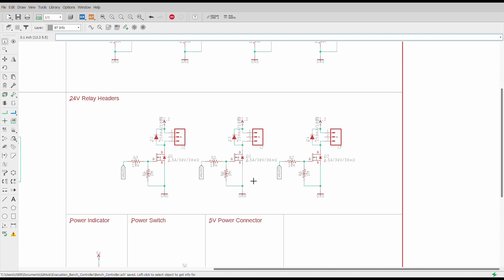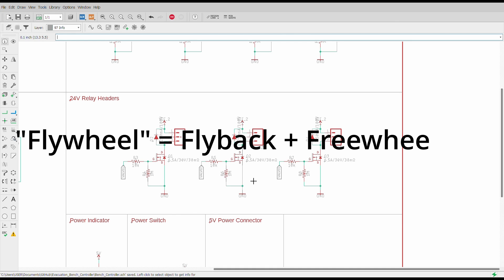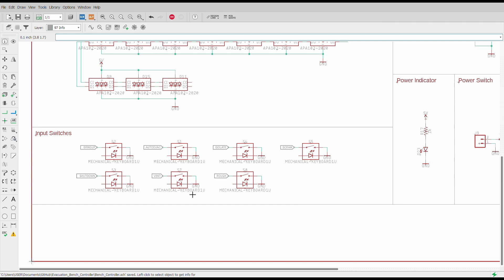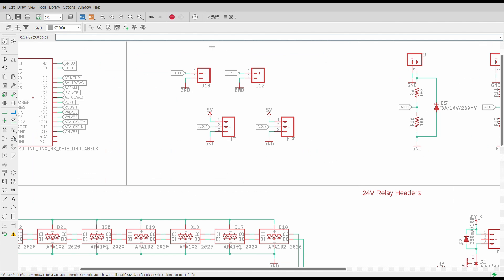In order to actuate the high vacuum valves, I needed 24V signals to send to the relays. This is a simple matter of throwing some MOSFETs on there, as well as some flywheel diodes because those relay coils are inductive loads. The status of the system is communicated through a bunch of LEDs on a panel. Addressable LEDs are so inexpensive now and save so much GPIO overhead that it was worth it to throw a bunch of addressables on there — and because they're also RGB, I get an added amount of information I can convey with each LED. Finally, there's a handful of mechanical keyboard switches for user interaction. That left a few ADCs and GPIO unused, so I broke those out to headers as well, just in case I need to expand the system later.